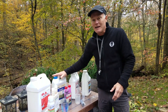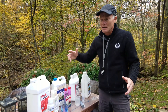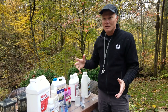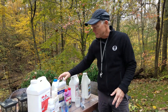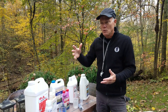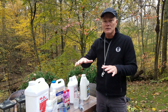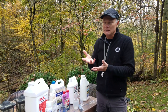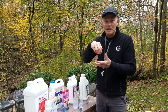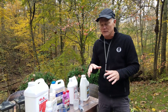We also add anything else we're putting in, like a colorant. For colorant, we use laser red or laser blue from Sanko Industries. The label says to add half an ounce per gallon, but we put a little more — a full ounce — because half an ounce is fine for viewing just after you've sprayed it, but after it's dried it's harder to see. Then, depending on what the product is, you may need to add a surfactant. A surfactant is a wetting agent for the herbicide — it allows it to sheet over the leaf surface rather than beading up. Without a surfactant, if the leaf has some waxiness to it, the herbicide just beads up and rolls off without getting any active ingredient into the leaf surface.